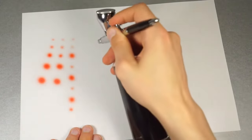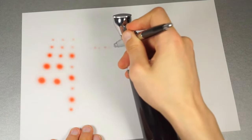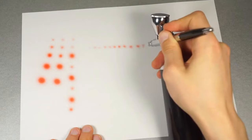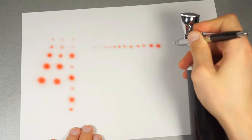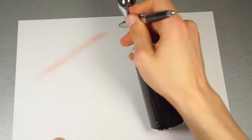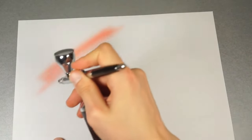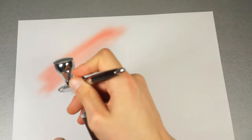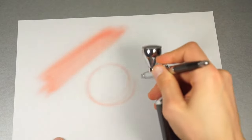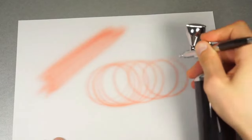But unfortunately, after a few minutes, I started to feel that compressor is heating up. So that means air from compressor will also get warmer. This inevitably will make paint to dry faster and it will affect paint atomization. During shading and line test, coverage was pretty uniform. It was more affected by my poor trigger control, but not by the compressor airflow.